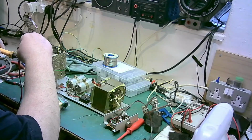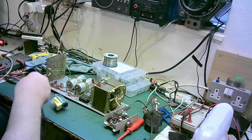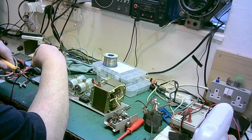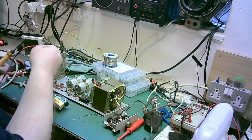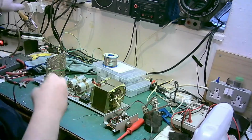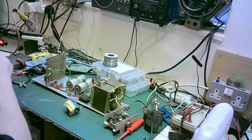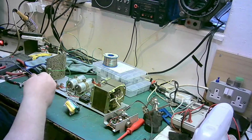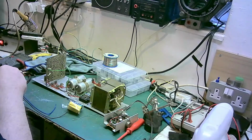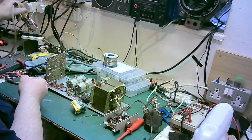Yeah, we're just melting the heat shrink down. Get it as far as we can get it, make it look good. That's actually not bad. And that way we'll end up with wires dangling around, so I'll pick up some P-clips or something. I used to have a staple gun for doing this sort of tacking, but I don't want to start tacking down with staples. I think that runs a risk of damaging the insulation. So it's going to be P-clips.